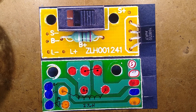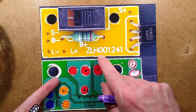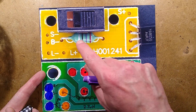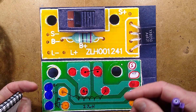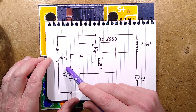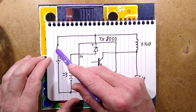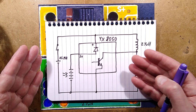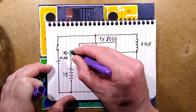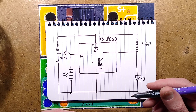If you're in a very sunny climate you could swap the inductor to a lower value, down to 10 microhenries for 40 milliamp output. In a darker climate you could increase it to 100 microhenries — dimmer but longer lasting. Here's the schematic: the YX8050 chip, a nickel metal hydride cell charged from the solar panel via an internal diode. If the switch is closed the battery charges; if not, it won't — but you can add your own external diode to enable charging with the switch off. Be aware there's no charge control, so extended bright sunshine could overcharge and damage the cell.